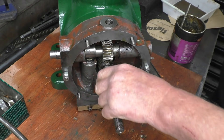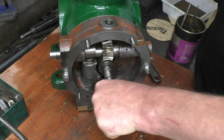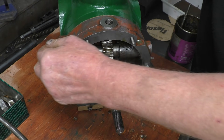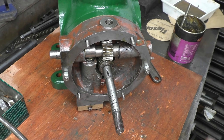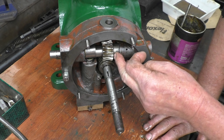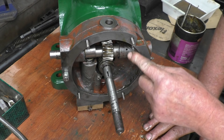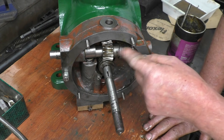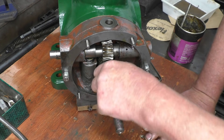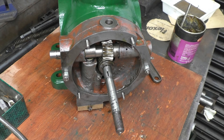Right, so that's in there now. If we turn the crankshaft you can see how that works. I'm going to put the crank bolt in so I've got something to turn it with. We need to turn it over — there's a grub screw goes in here and you have to lock the shaft into there. See those oil holes here — splash oil holes — and little drain holes down there. Certainly a well-thought-out little unit.